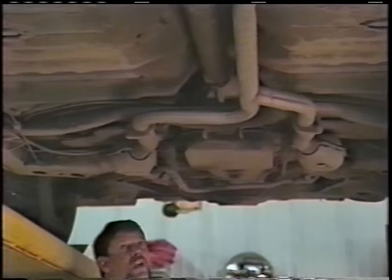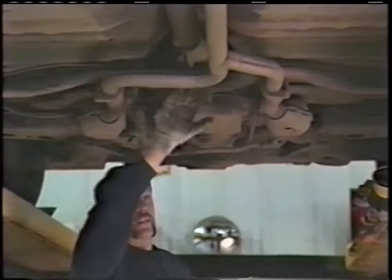Remember, safety first. Remember where the system is going to come down when you go to cut it. That thing could drop down and swing and hit somebody or yourself, or cut your torch hose in half and maybe cause a fire that way. Always think of the safety. Keep your torch hoses behind you, your air hoses behind you, etc. And watch where you're blowing your sparks.